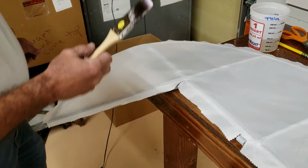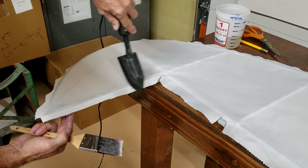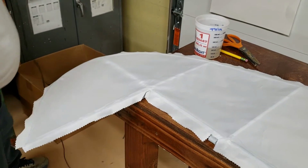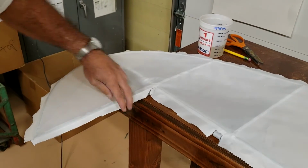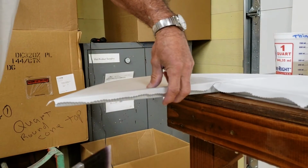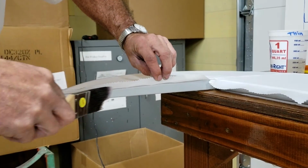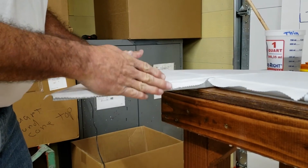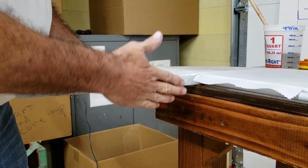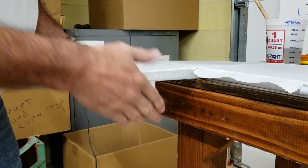But two ways you can do this on a sharp edge: you can take an iron sometimes and start that corner over, see how now I've started that corner over a little bit with that iron. You can do it that way, and then it would glue down okay. Or, like I was saying a while ago about re-wetting it, you can come in here and give this a back dressing across, now you've just reactivated those two thick layers of glue. And sometimes when you go right at it, it may want to come back up, which means you got a little bit too wet. But it goes down real nice and works from the end out, and it's smooth, and there's no glue on your hand because it's really on that wet side.